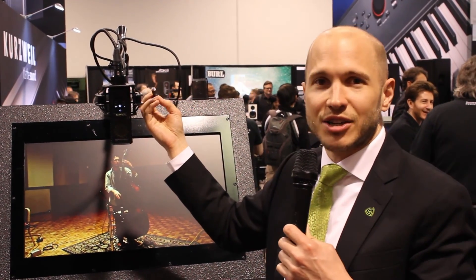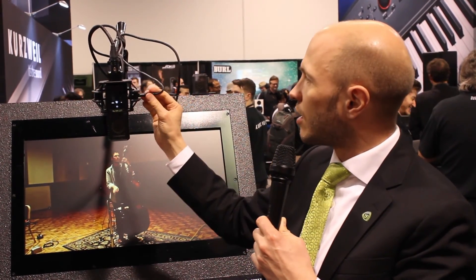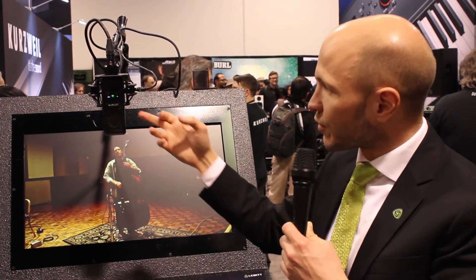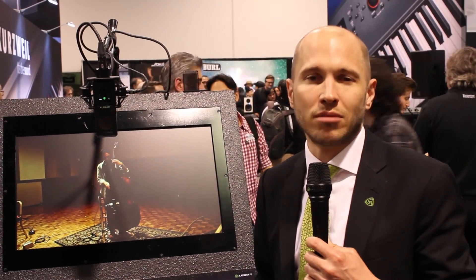What makes this piece really a cool tool is that you can connect a second channel on the right side of the microphone. Now basically the front diaphragm gets recorded on one channel and the back diaphragm gets recorded on another channel. What this enables you to do is select polar patterns in post-production, so no need to set your polar pattern prior to recording. You can do it conveniently under monitoring conditions at any point during the recording.